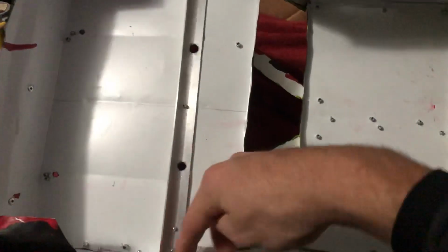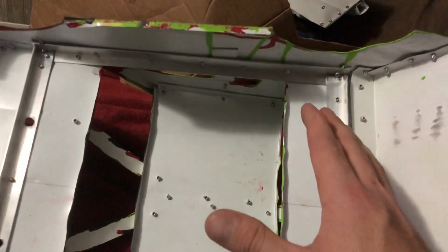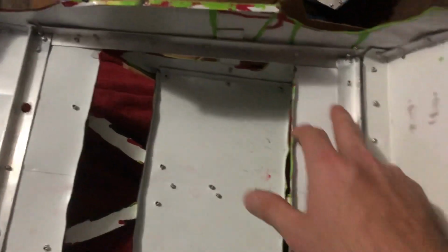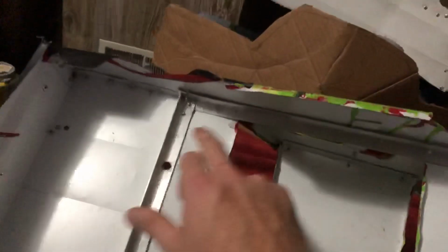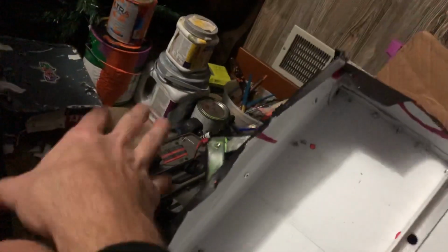And then this is built to my rules. I can't go past, and it's just got to be a 4-point cage. You also can do bracing. I do not do the bracing just because I don't have enough metal to use for bracing. But if I wanted to, I would put bracing from here to here, here to here. You're allowed basically all 4 corners. That helps hold the cage in very well. Keeps it from getting pushed in, again, from components getting damaged. There's only so much that these little bumpers can do, and this cage helps a lot.